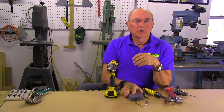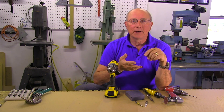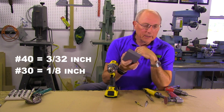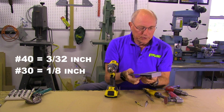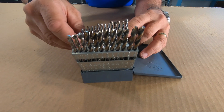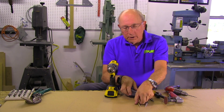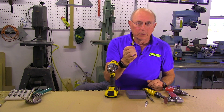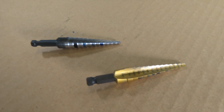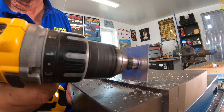You're going to need a certain number of drill bits. Drill bits for metal airplanes are generally going to be number 40 and number 30, and then a wide variety for specialty screws — but a 40 and a 30 will get you most of what you need. It doesn't hurt to have a complete box of drills with a drill index so that when you need that odd size, you can find just that one, and if you break one you can replenish your set. The other kind of drill you'll use a lot will be step drills. Buy good ones — they're not cheap, but once you have a good set you'll be able to drill any size hole above the small ones and go precisely to the diameter you need for specific tasks.